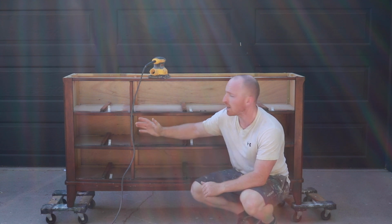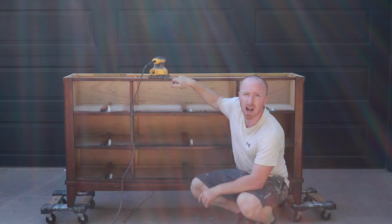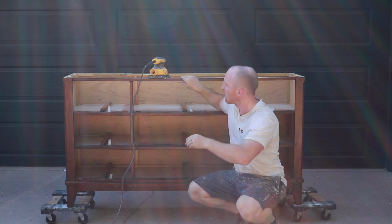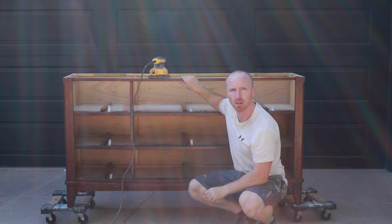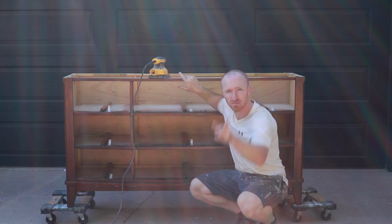We're going to sand everything down just to scuff. We're going to paint it afterwards. So 80 grit, DeWalt, going to do everything. Make sure the top is smooth, so once we put the new top on, there isn't any glue marks or anything like that holding the wood up any higher than we need it to be. So we'll go from there. We'll build the top after we get this sanded. So let's get started.